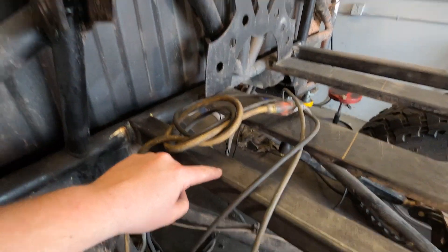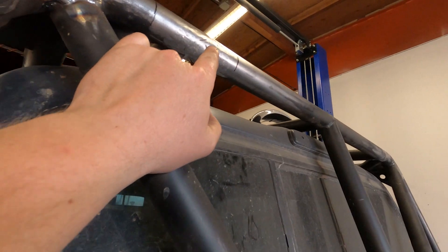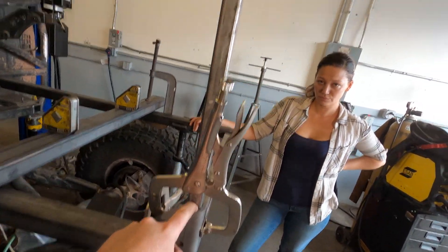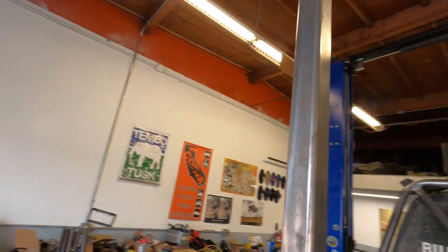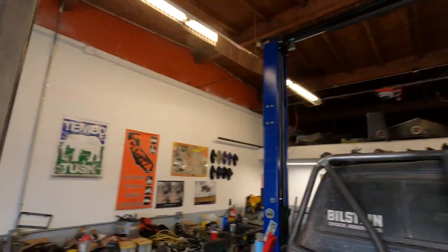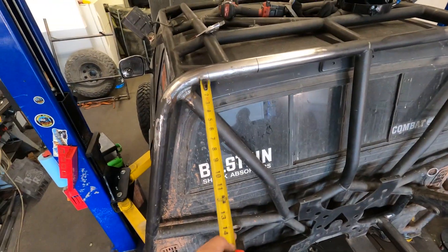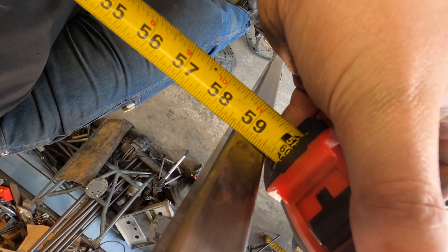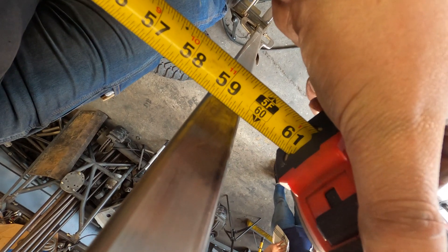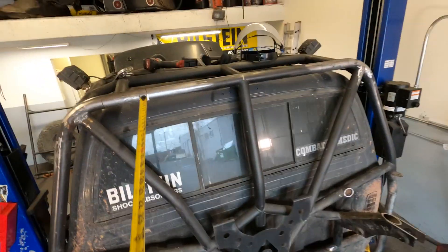I measured from the top part of this tube to the bottom part of where we're going to land this thing — about 38 inches. At the end of this piece I put one of these little 90-degree framing squares on the square tube and marked it at 38 inches right there. Now I'm going to measure from there to here and that'll tell us how long that top piece needs to be. These Milwaukee tape measures are so badass because they have a little magnet on them — you just stick it right to the metal. That's our line — it's almost exactly 60 inches, so I'll cut them to probably 61 to have enough room for the notch.